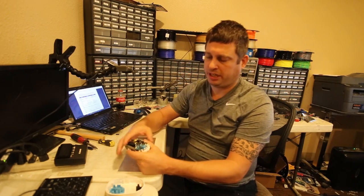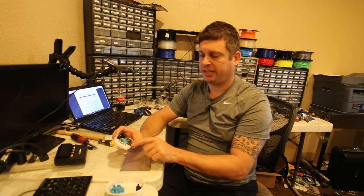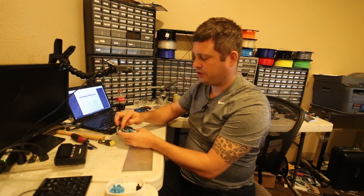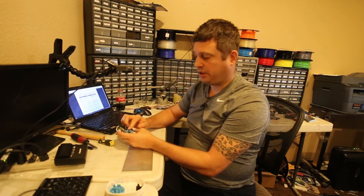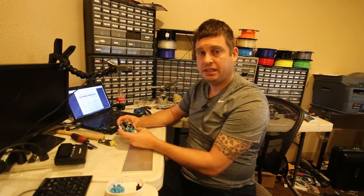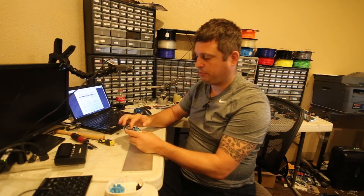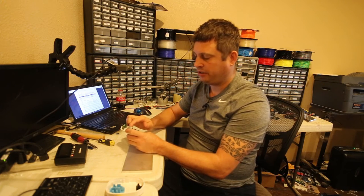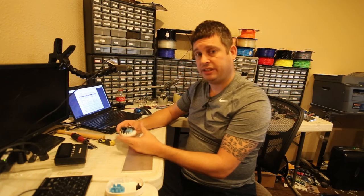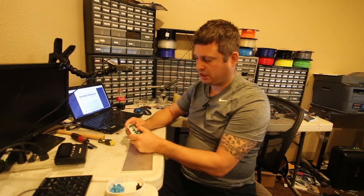The ground comes in and it's a pass-through from the back to the outlet side, and that ties to the high-voltage board. This is the high-voltage board, and then there's a low-voltage and computer board. The ground is just a straight pass-through with no tie to the device — it's probably a floating ground. The hot leg comes in and is picked up on a piece of wire and brought to the board, and there's a return that goes to the other side — they split the hot leg. It is not a UL-listed device, but they attempt to provide some safety with what looks like a fusible link.